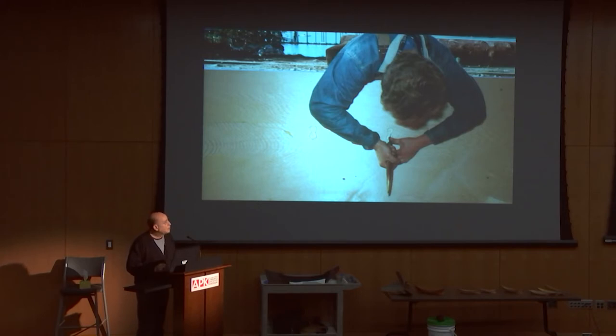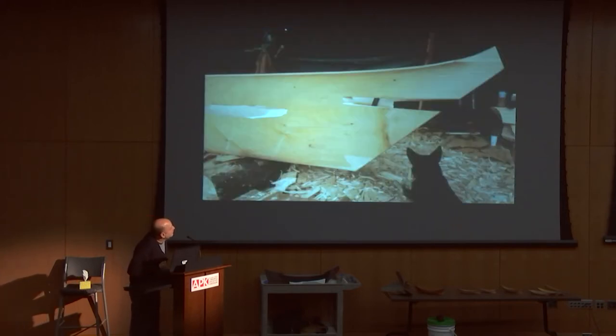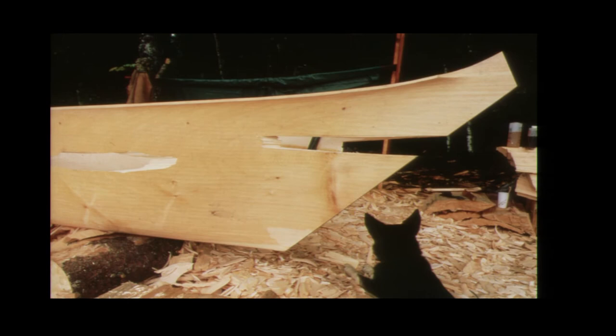We use these figure-eight plugs. Where the waist is on the plug, that's the way the crack goes. What you're trying to do is catch the crack and keep it from pulling apart. I think everybody a long time ago had canoe kits, and repair was real important. Before we steamed, when this tree was up, we think it got wind shook near the bottom. Sometimes when you leave a hinge as the tree breaks and falls, it yanks it down — see that hole there? It just echoes through the whole log. Steve, being the expert he is — he's the king of patch — and a lot of your canoes have patches. It's no big deal.